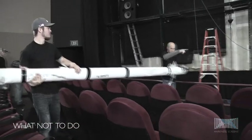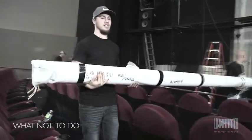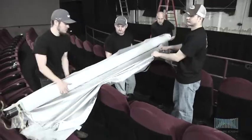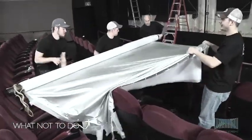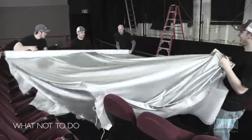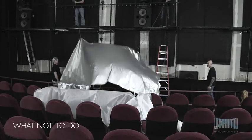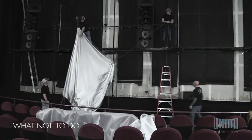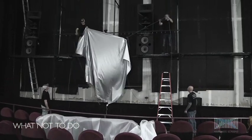Harkness Silver screens are designed to be installed vertically and not flown over the seats unless a vertical installation is not possible. Where installation over the seats is needed, the screen should be supported and lifted slowly into position to avoid creasing and damage. You should always seek manufacturer's guidance prior to install.